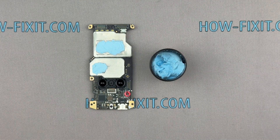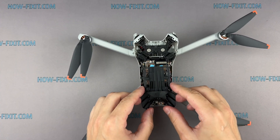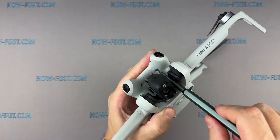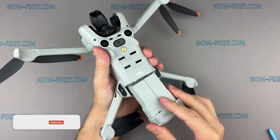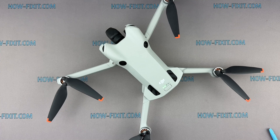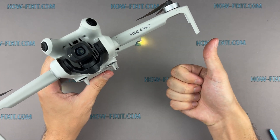Now that you've finished with the motherboard, inspect the ESC board for any signs of corrosion and clean it if necessary. Also clean all cables and connectors that attach to the motherboard using isopropyl alcohol. Once everything is clean and dry, reassemble the drone and try powering it on. If you have any questions about drone maintenance, feel free to leave them in the comments. If you found this guide helpful, give us a thumbs up and subscribe for more tech tips and guides. Visit our website for more tech insights and do-it-yourself guides. Remember, every tech challenge is an opportunity to learn and grow. Thanks for watching HowFixIt and see you in the next video.